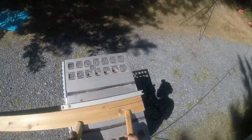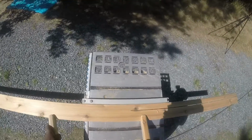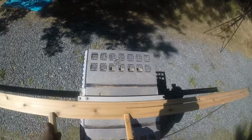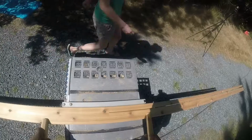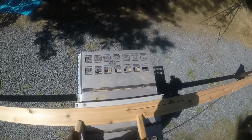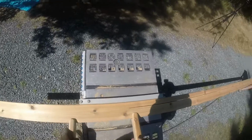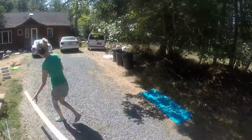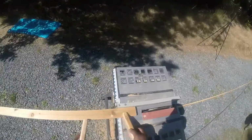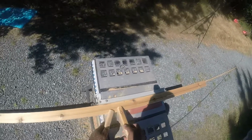So a couple of things about this. When you are cutting out rails, you have to be careful because the wood you're cutting them out of is really long, and the blade on the table saw is sticking up kind of out of the material. And so I'm using 2 push blocks, and my wife is helping by slowly feeding the board in from behind. If I had a nicer table saw or a larger in-feed and out-feed table, then I could maybe do this by myself, but given the tools that I have available, this really is a 2-person job.